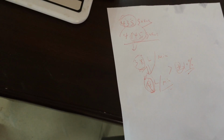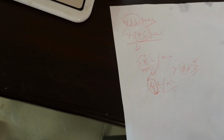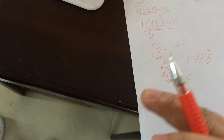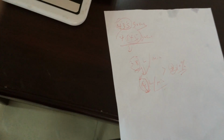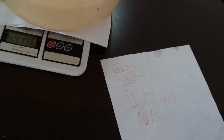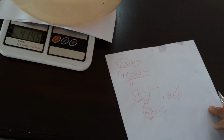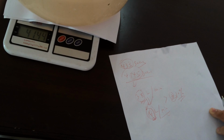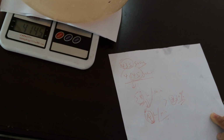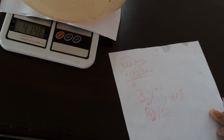So, my friend, I do sincerely advise that you have some retest at horizontal level, the same level between the pump and the destination. Then you can test it for 1 minute and you can calculate its real flow rate. And I guess you can get the exact value.